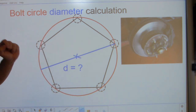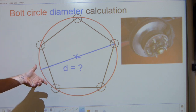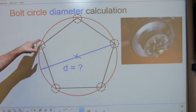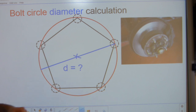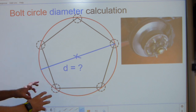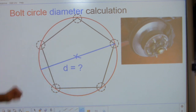First, terminology. The bolt circle — also known as pitch circle in the automotive industry — is the red circle. The holes are marked with broken/dashed lines. These can be either holes in the wheel or bolts in the hub or studs in a pipe flange. Their centers can be connected forming a regular polygon: four-sided, five-sided, six-sided, or whatever.